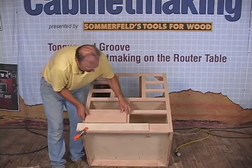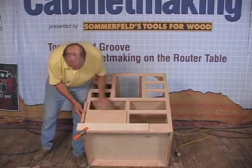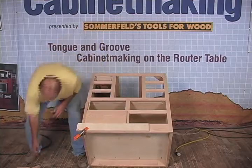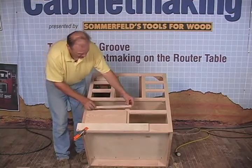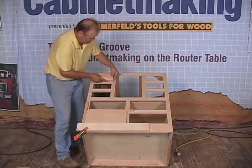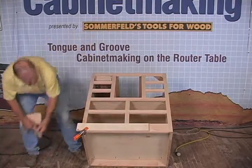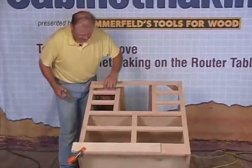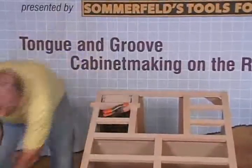Now when we put our drawer front on there, we're ready to go. And we got 1 1/2 inches here, so we're going to take a 1-inch strip right here, right there. We know that's where that drawer is going to go. So we'll put it on, assemble it, keep going up. This is a 1.5 inch rail here, 1/2 inch overlay. We're already 1/2 inch, so we put a 1/2 inch in between, and we just keep working up and we put that drawer on. We keep working our way up until we're up to this top drawer, okay? So when we do this now, let's just get to this top drawer. Since this rail is 1.5 inches and we want a 1/2 inch overlay, we got a 1-inch strip of stock here. Okay, we're just going to put that 1-inch piece here.